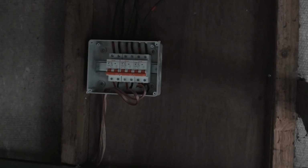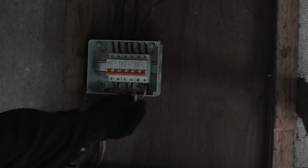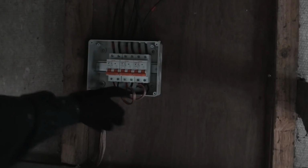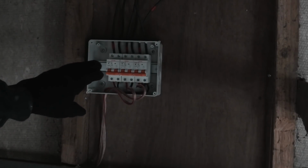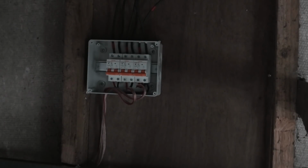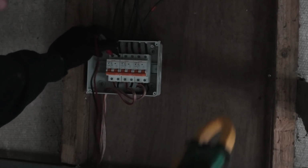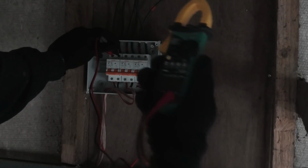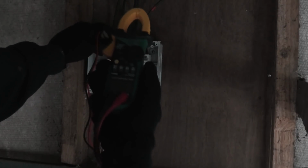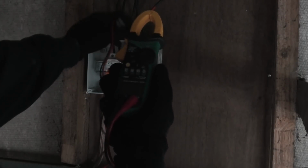But otherwise, this should be as it was before, which is pretty awesome because I have two cables going down into the basement to the charge controller, and now one of them just has a single string of panels on it, the middle one, and the other one has two panels on it. So it's going to be very easy for me to split that up. One for the lithium ion bank and two for the lead acid bank. So let's see, 143 volts. Let's see this one, 144.3 volts.